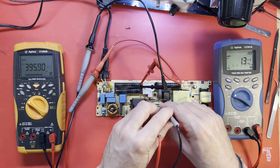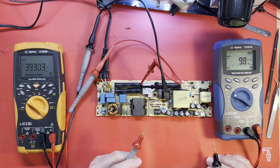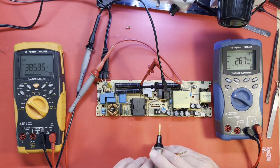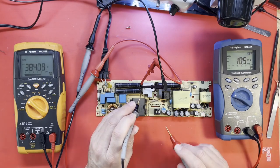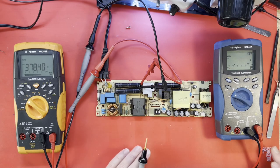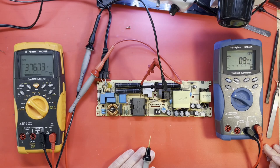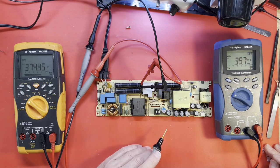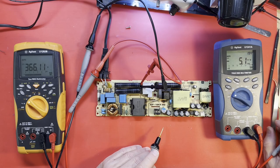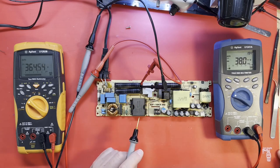No, it did not even try. Our fuse must be good because the 5 volt would rely upon that also. Checking here: 380 volts, so it's not something simple like a blown fuse. Maybe we need to look at the supply voltage going into that IC. I'm going to bet it is getting supply voltage because it's the same supply voltage that feeds the power factor corrector IC, and that's working.